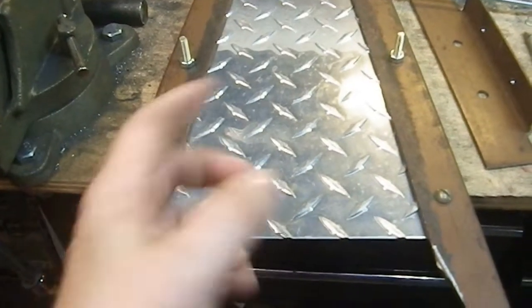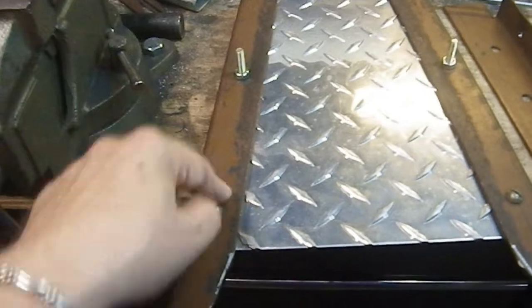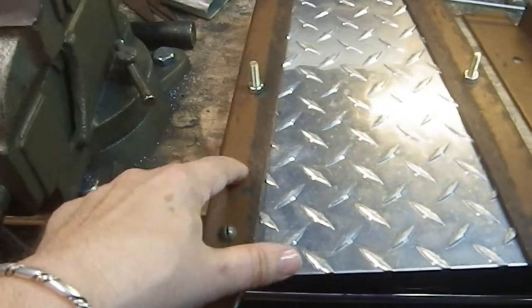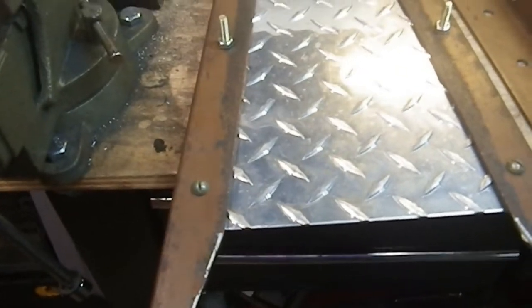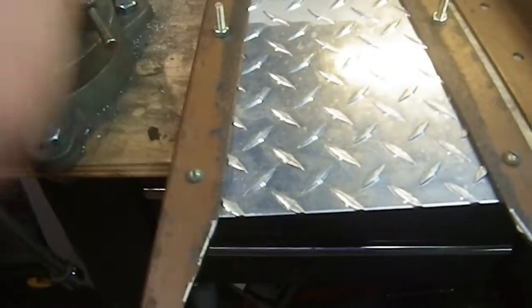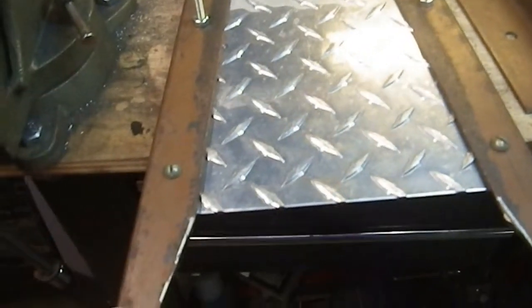I mean, these would not have to be changed. I would have to drill 3 new holes, but it's just aluminum, and since this is my guide, I really don't have any measurements to make for those. Just take 2 inches off, put this on there, put it where I want it, clamp it in place, drill, drill, drill, and you're done.